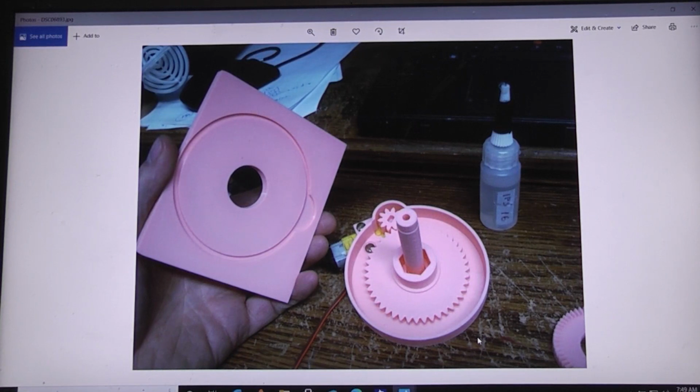But I gave in that first video that you should go watch three other options. You can 3D print that disc rather than pay a machinist to make them for you. And if you print them on an FDM printer, unfortunately, they won't be clear. So what you can do is print that part on an FDM printer, make a silicone rubber mold, and then cast the discs in clear resin. Another option is if you have a resin printer, you could probably print them in clear resin and they would probably be fairly clear. Not owning a resin printer yet, I can't tell you for sure.